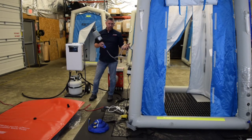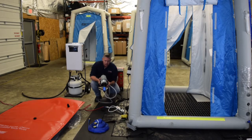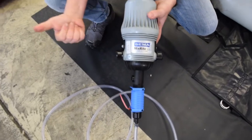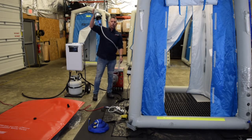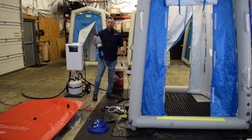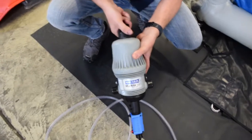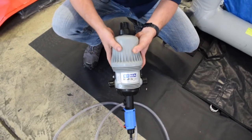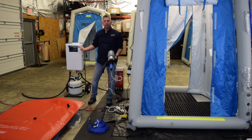The next item included with the DAT 2020S system is the detergent injector. This is an inline injector — water flows in on one side and exits the other, and this is going to be on the hot side of our water heater. We have enough hose on this injection unit that we can put it in the reservoir of our choice based on the solution deemed appropriate for your response. On the top we have a control knob: turn counterclockwise and the knob comes out, meaning soap injection is flowing. Push in and turn clockwise to turn the injection off — the solution is no longer flowing but you will still have continuous water flow.